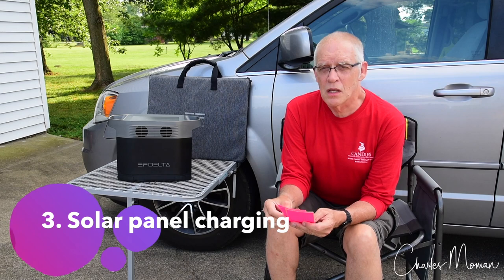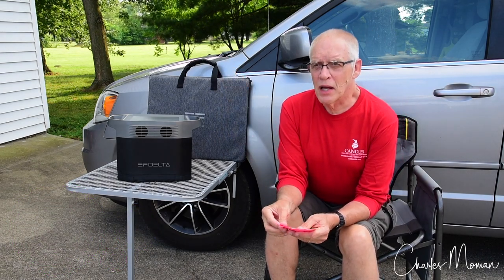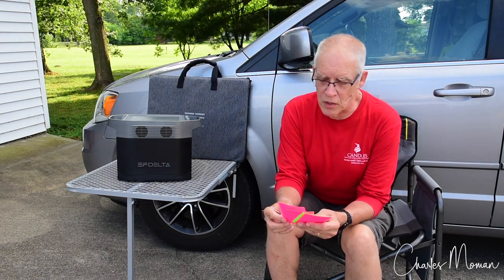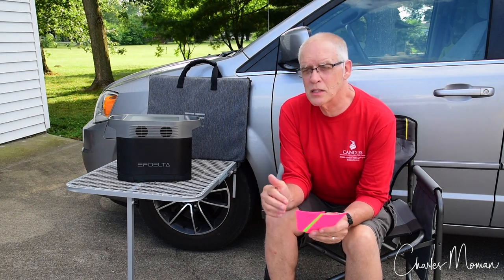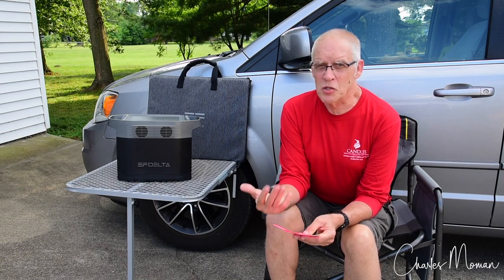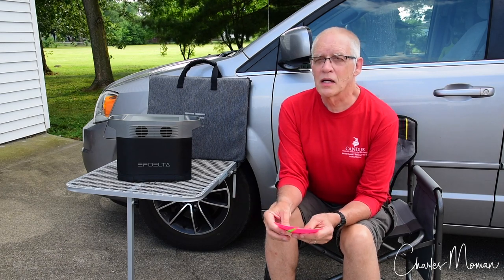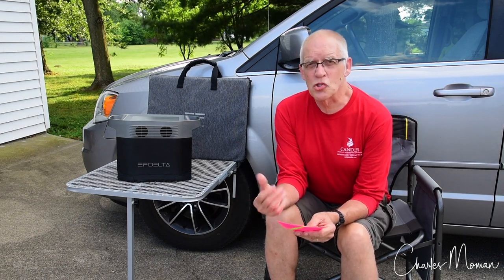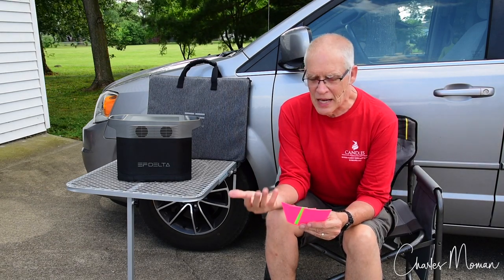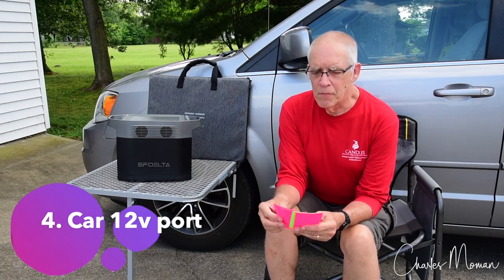With solar they say four hours, but that means four hours if you have 400 watts. I've got a 100-watt panel on top of my camper, plus the EcoFlow 110, and a Jackery Solar Saga 100 as well — but that's iffy because you have to get them angled right and have a sunny day. If you've got a bunch of panels on top of your van, camper, or schoolie, you'd be able to get this charged back up in about four hours in perfect sunlight.